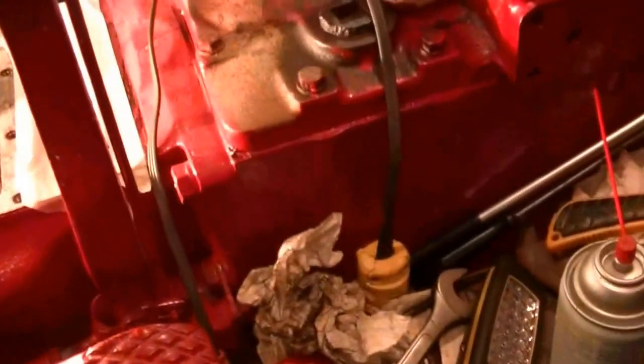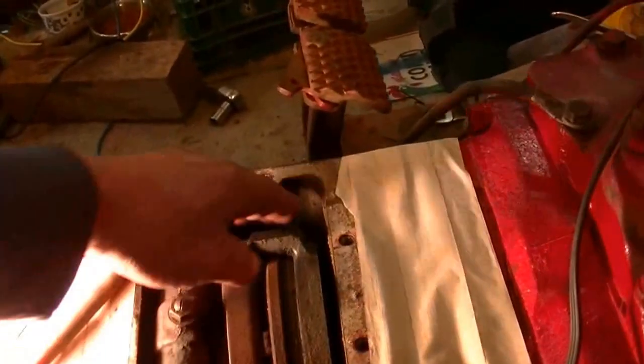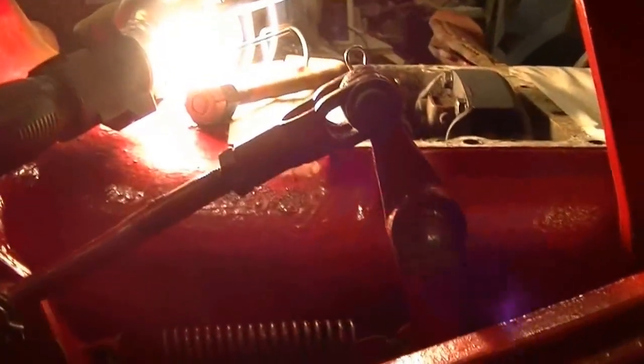I'll move the lever back and let it lock, and now this clutch should be free in here. And that it is, and you can tell by the Sprag clutch that it'll only turn one way. I can't go back with it. So there you are. Everything's all back in order with used materials and the clutch fingers being set. I'm able to get these rods and different things back in proper order.